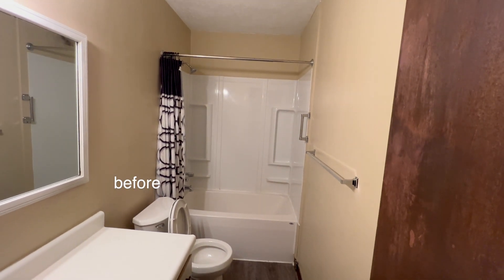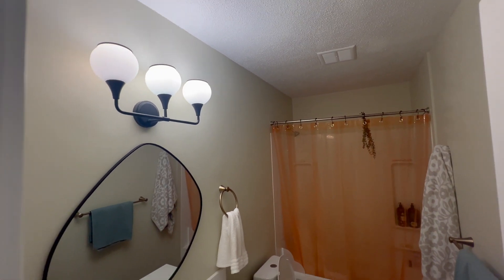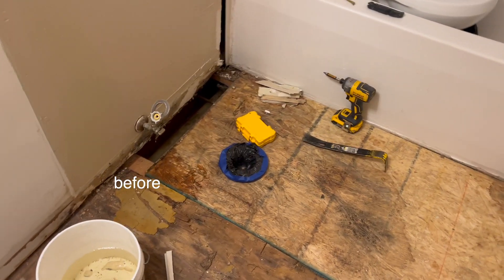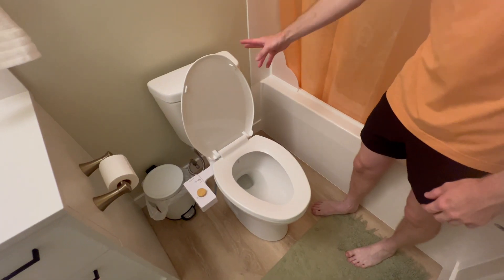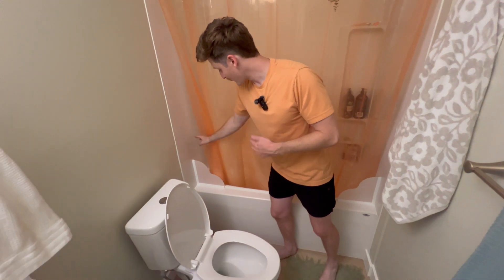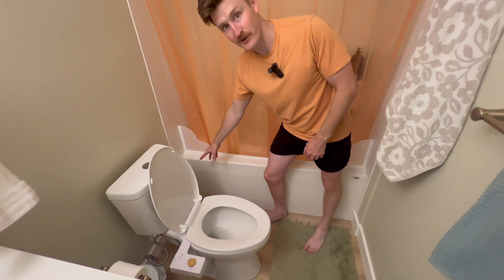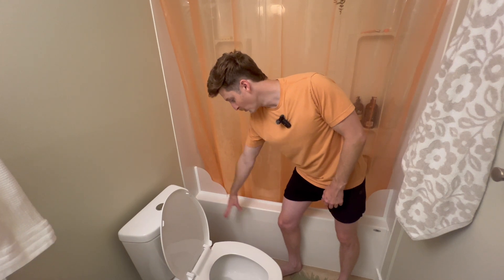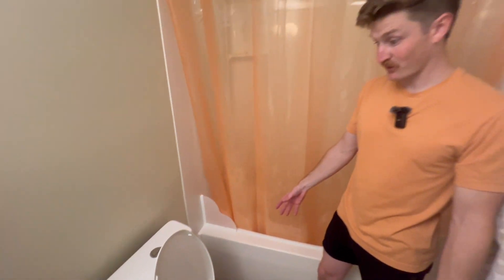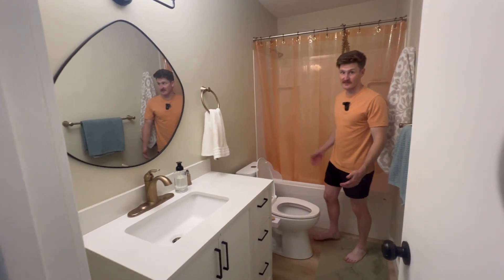The primary bathroom — we didn't do a whole lot. We didn't do anything to the tub, so the tub is still original. In the renovation video I talked about all this subfloor that was damaged by water — we had to tear all that out and replace the drywall. We found out the reason was the shower: whenever water would drip down the wall, it would run down to the top of the tub, which is slanted in a way that all the water would just dump over this corner and pool up right there. That was definitely the problem. So we put silicone dams here and corner guards, and so far that's worked out.